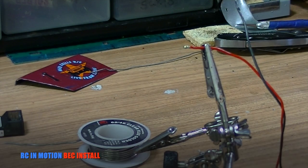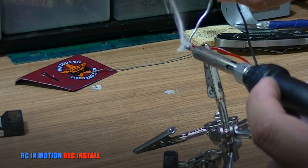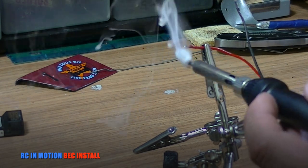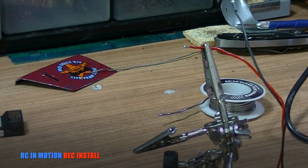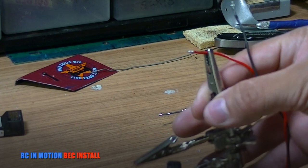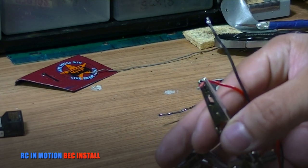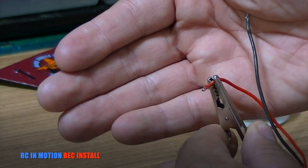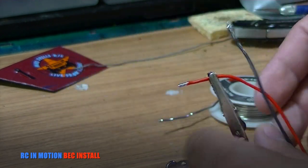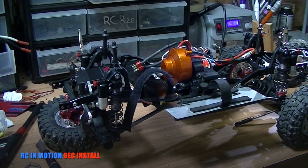Make sure your soldering iron is hot — I usually maintain it between 780 to 800 degrees. Put the iron underneath and start soldering the wire. This is called pre-tinning, and what you're left with is a clean, nice pre-tin. There you go — nice and clean.